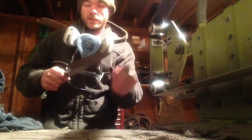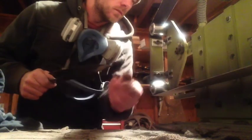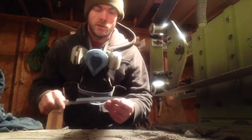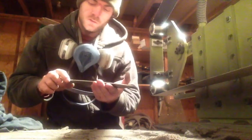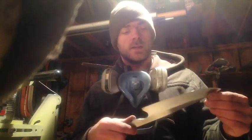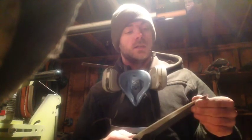There you have it — polished up to a ceramic structured abrasive, this one's rated X9 or something like that. It's the finest one I can buy where I buy them, so it's a pretty nice polished finish. I said I was going to do a hand-rubbed finish on this one with sandpaper, but now I'm not so sure — I kind of like the way it's turning out. Now I'm going to wrap the blade in masking tape so it doesn't get scratched up during the rest of the process. And that's it — that's how it goes from fresh from the heat treater to ready for a handle. Thanks a lot for watching, I'll be back with another video soon.